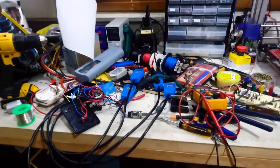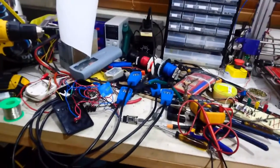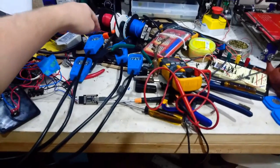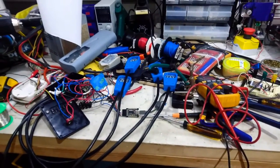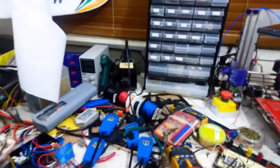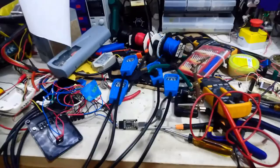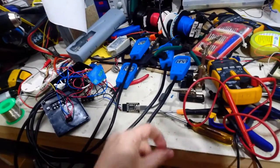Beehive monitoring system update. So, number of problems I had with the original system. Number one, big thick cable going into the strain gauge of the very, very fine cable. I thought I had enough strain relief on it with a couple nested layers of various sizes of heat shrink, but I did not. It was very cantankerous. I'd bump it and it would break connection, and I'd get totally silly readings for my weight because it went open circuit.